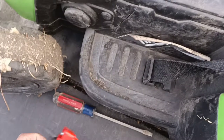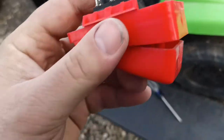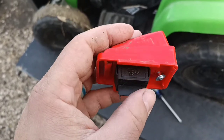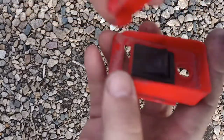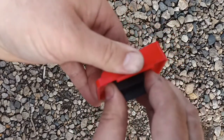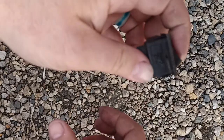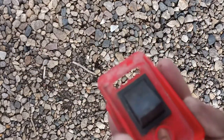Super easy switch. They sell one on Amazon — it has six connections, but you can buy that one and you only need two out of the six connections. If you take the screw out, you don't actually have to buy the whole foot pedal, but they're about the same price. This just comes apart and it's just a momentary rocker switch. They sell those too. So I just ordered the foot pedal and I'm going to put that in as soon as it shows up, but these are super easy to work on.